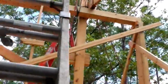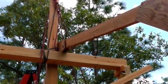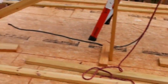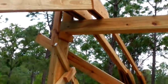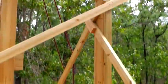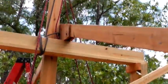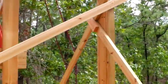Let's go up here. You can see how I have the bracing set up. I just have some 2x6s screwed into the floor over here and over there. You can see the rafters — they're resting on it. This one is tied off and I'm getting ready for the next one.